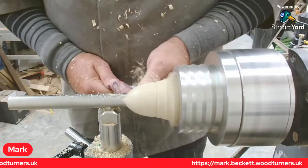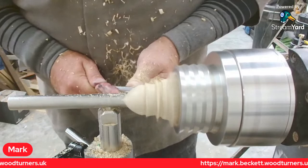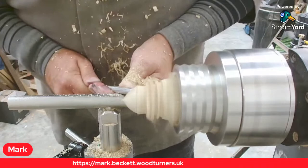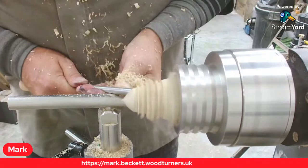So, spindle gouge. It didn't really work. I don't know whether you could use another tool like a gouge, just the wing of it bringing tight, you know. Oh, there you go. That's working. Yeah, I never tried it. I thought about it the other day. I use the skew tool, you know. The flute is almost completely closed. Yeah, you're right, tight. And you've got to dig in with the point.